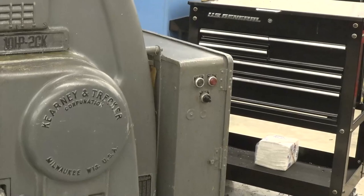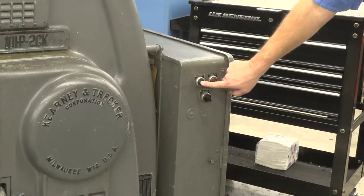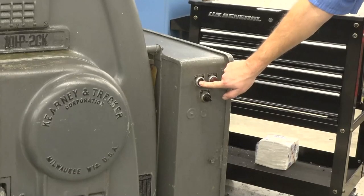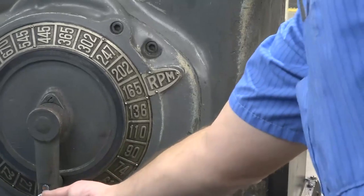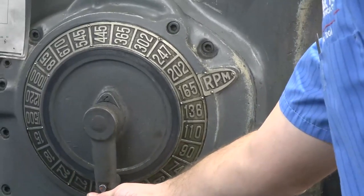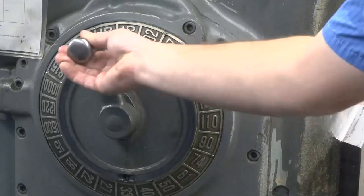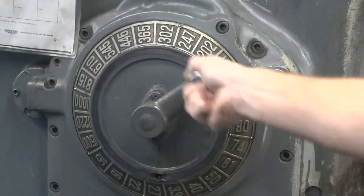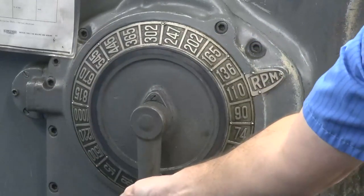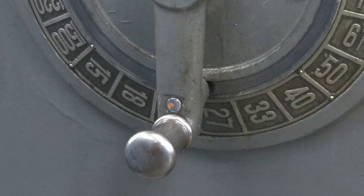The K&T main power switch starts machine operations. Turn on the main power by pushing the master start button. You can select the RPM using the RPM selector on the side of the machine. Start by making sure the spindle is turned off. Then pull the lever handle out and rotate it until the desired RPM lines up with the RPM letters. To put the machine in gear, move the lever down and engage the pin in the end of the handle in the hole.